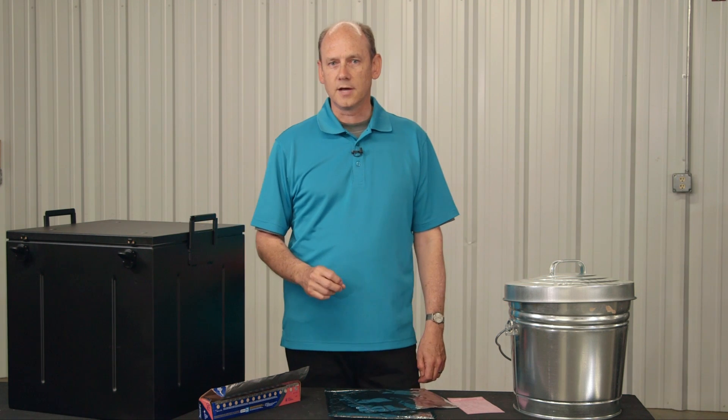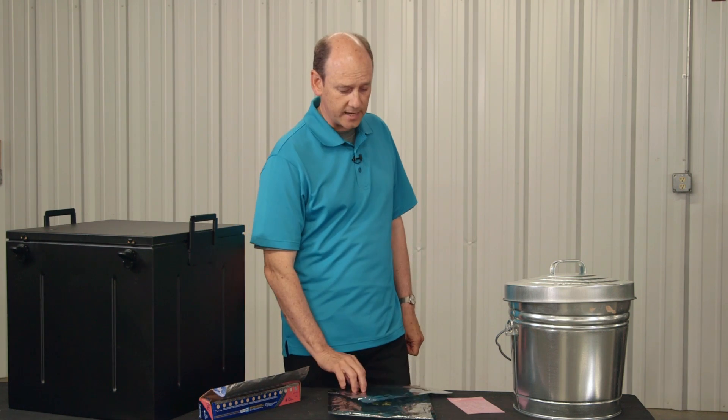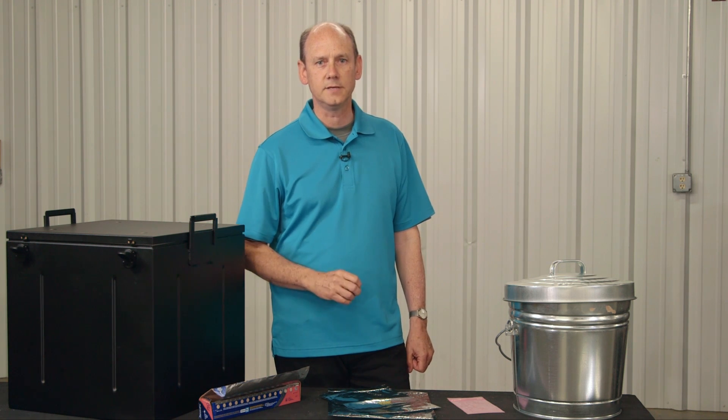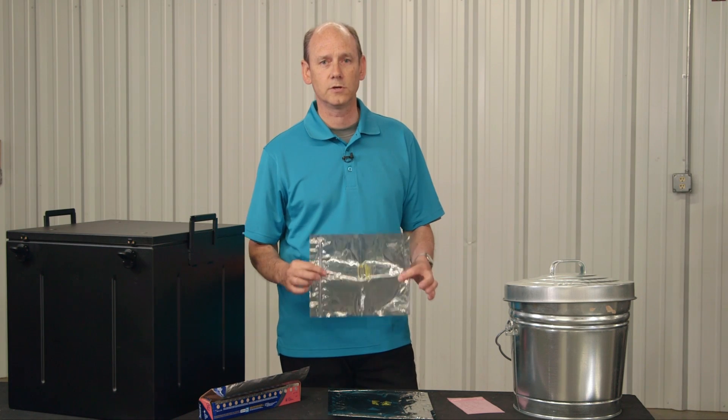The TuffBlock's special design achieves each of these goals. All of the do-it-yourself examples we've listed do not achieve at least one of them. For example, a microwave does provide protection at a specific frequency at which the oven operates, but not over the broad range of frequencies present in an EMP. Anti-static bags provide a modest amount of attenuation of radio frequencies, but cannot handle the energy levels present in an EMP. The bag might even deteriorate under the surge currents that would occur during an EMP.